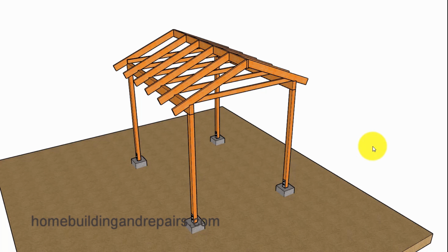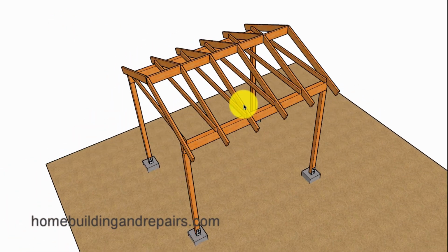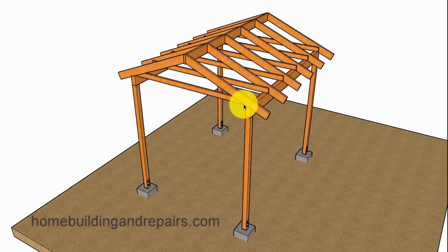Here is another problem you could run into as a carpenter or do-it-yourselfer. I actually ran into it quite a few years ago and thought I would share my experience with you. In my experience, the mason located the footing in the wrong spot. It was over just a little bit, and then I didn't plumb up the post or vertically level the post.